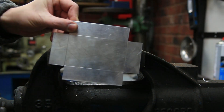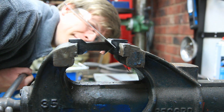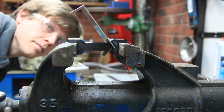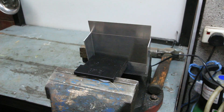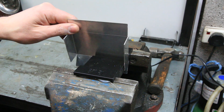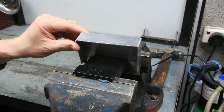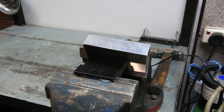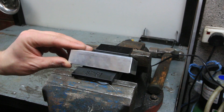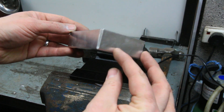These are printed in PLA, 30% infill on gyroid. I made something using a pattern in the press brake to make a little pan. Folding up the first side — it's a joy to use. I'm going quite slowly, but the footage is sped up because ain't no one got time to watch me work. You go slowly, make sure you've got the angle right and position right, and you can do some really high-quality work. It's quite useful to print them narrower — if you want to do long folds, you can, just move it backwards and forwards. Because it's narrow, it gets in between the sides you've already folded up, which can be a problem with traditional metal folders. And that's it — a completed pan. It's very pretty, only 1mm aluminium, but very pretty.